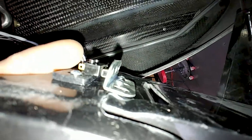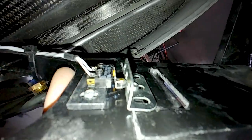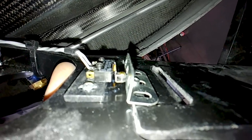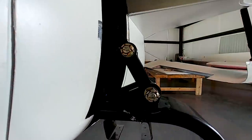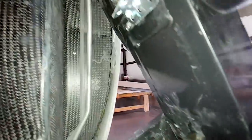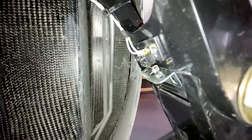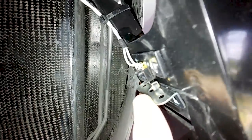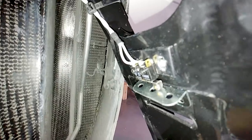Welcome back. Starting out Monday, I was the only one in the shop for the day, so I just had a quiet day working on stuff with the main landing gear. What you're looking at here is a little micro switch that indicates whether the gear is down and locked. I got that mounted and also that little bracket there for it to engage against, adjusted it so it just clicks on when the gear's fully over center - same thing on the other side. I previously had a magnetic reed switch there, but the little magnet on the bottom kept breaking off - it had a plastic housing - so I had to get rid of that and go with this.